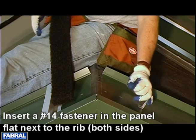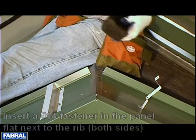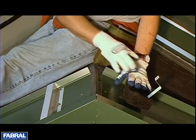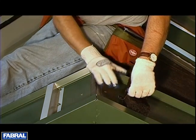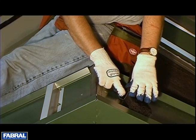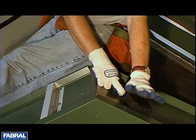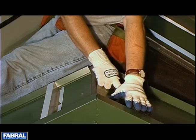I would recommend lifting this out of the way after you've got it in. Roll out the profile vent — notice it's notched for the seams, so it will fit right over top of the seams. Once you've got it rolled out, you can come back, put the profile vent down, and put another screw in. That holds the profile vent in place. This profile vent will allow the transmission of air, but it will not allow weather or debris to be blown back up into your roof.